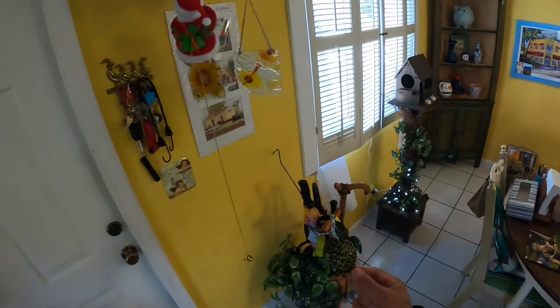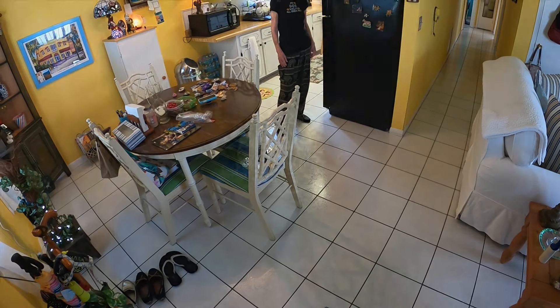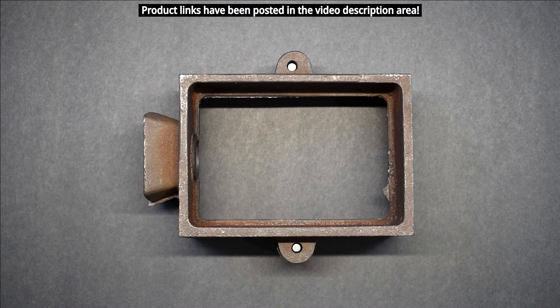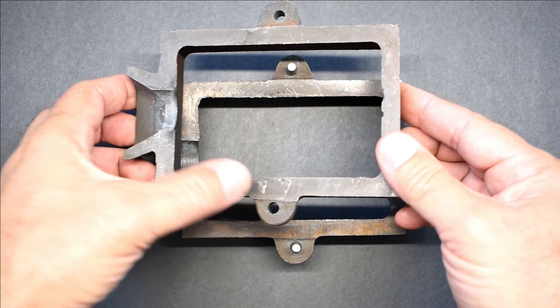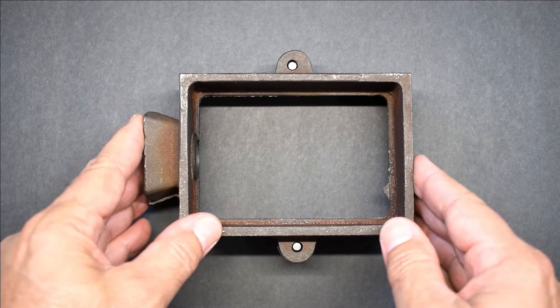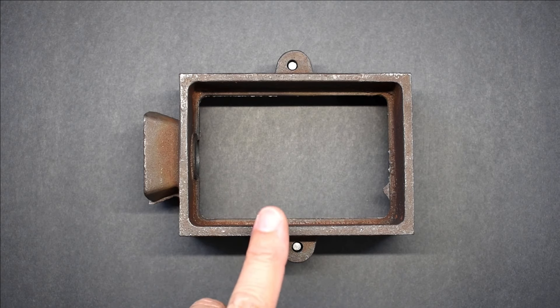Okay Rose, I'll help you with the refrigerator, and I'm going to make a mold of this and bring it back when I'm finished, and then you'll see the video. In order to duplicate this turtle, you're going to need a cast iron mold. This size right here is ideal for smaller objects, but they do sell these in larger sizes. You can see both sides of it — one side has pins that go inside these holes. The sand I'm going to be packing into this mold is petrobond, an ultra-fine sand that gives high detail when the object is poured. It's made from a mixture of sand and clay that's oil-bonded.